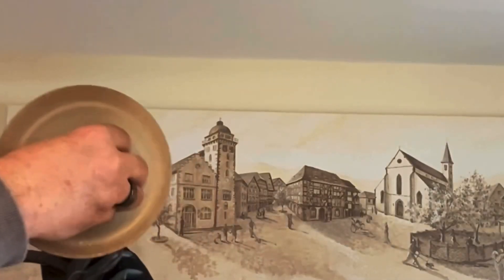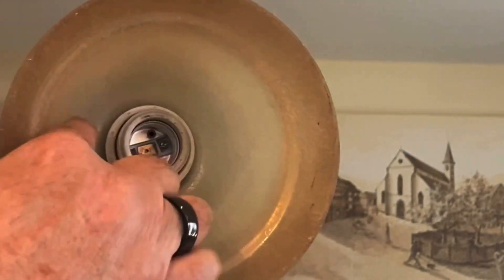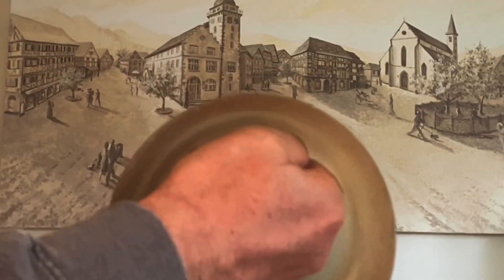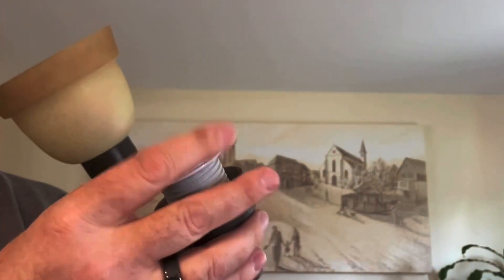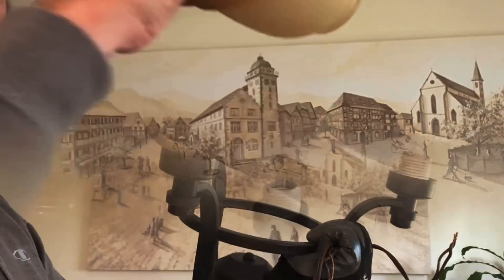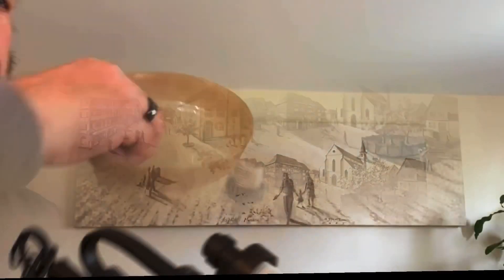Now I'm preparing the new fixture to hang it. I'm going to take all the sconces off — that's what I'm showing you here. There's a lock ring in there, unthread it, take the sconce off, put the lock ring back on so I don't lose it. I'm going to do this with all three and that'll lighten up the load on the new fixture when I'm hanging it. It's about ready to go, so I'm going to hang it up by this threaded piece here into the bracket that came with the light.